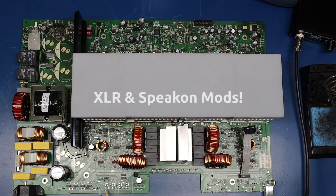Basically you remove the four wires, move the four capacitors, relocate the four resistors, and then this is freed up. This amp is going to get completely recapped and then we're going to install those jacks. I'll come back and follow up once the jacks are installed and the recap is complete — we'll see this thing finished and I'll show you what the back looks like and how the interfaces work.